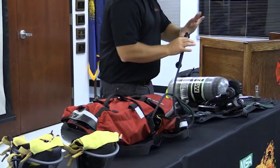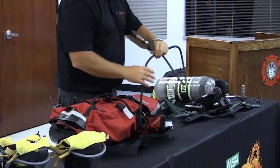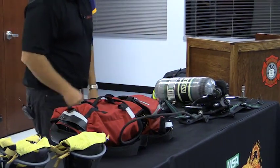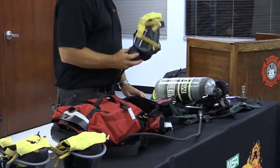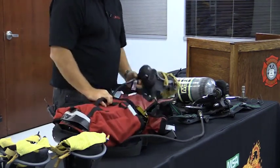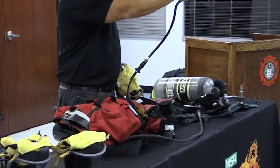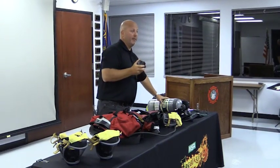Make sense? I'm going to skim over this because I think it's already familiar to everybody. If there's somebody who doesn't know and has more questions, let me know. But now I can't get to that fitting, okay? So now I go into my option B, C, D, if you follow me. I have a buckle right here. This opens up to an SCBA mask and second stage regulator. I also have the hose system that comes out with a quick disconnect. So now I can connect a regulator, or give that person who's down a regulator. Obviously what's happening then is they're breathing off of this system and not breathing off of their SCBA.